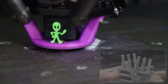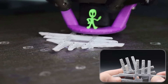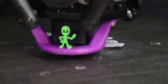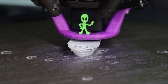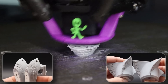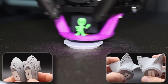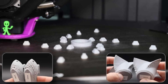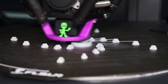The UFO did really well on the Cliffhanger test — it was able to cool the filament quickly to set the shape so it didn't sag too much. This duct is extremely loud; I had to wear hearing protection while printing. Although it did well on overhangs, overall part cooling suffered quite a bit: for the Benchy and the Shuriken it was not able to cool parts quickly enough. For the Benchy it produced something more like a blob than a boat. On the Bridge Burst the air was directed straight down, which forced the initial bridge layers down as well.